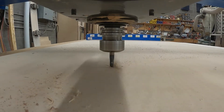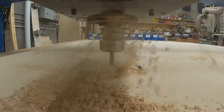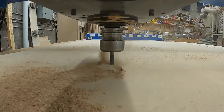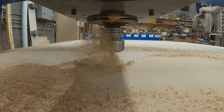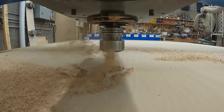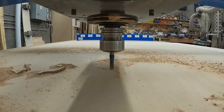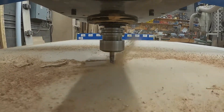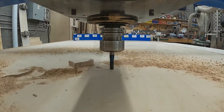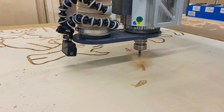We're starting out by cutting some of the interior contours — this is maybe an eye or something like that. As you can see, the router cuts through the material in one pass, which is nice, but it does leave those little pieces free-floating, and these pieces are just too small for the vacuum to hold down. So you can see there's also a little bit of tear out there. I don't know if my bit was getting dull or if this piece of plywood was just not in the greatest shape, but we made it through.